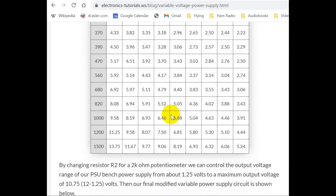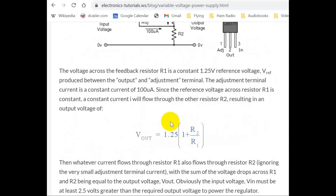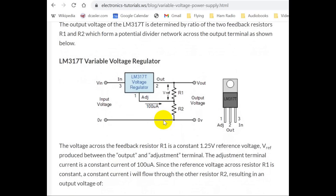Those resistors were a little bit hard to find, so I ended up having to get a combination of resistors to get the resistance I wanted. This is the circuit we're going to build, plus we're going to put capacitors — a fairly large electrolytic across the input for voltage regulation and the same on the output. We'll also put a small-value ceramic cap to take care of RF, because electrolytics don't do well at very high frequencies. So the smaller cap takes care of that. R1 and R2 are set by the formula.